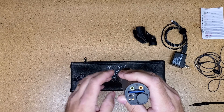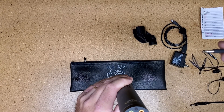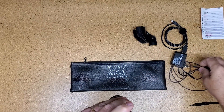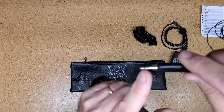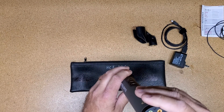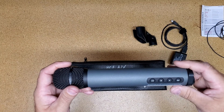We will mostly be focusing on the headphone jack. If you want to hear what the mic is recording while it is recording, you are going to have to use headphones. I tried the headphones from my old phone, which has the 4-pin connection TRRS — that doesn't seem to work, so you are going to need to use headphones that have the 3-pin connection, or connect the headphones to a mixer so you can control the volume. It is not necessary to do, as it auto-levels, so it should be able to record without you needing to hear what it is doing.